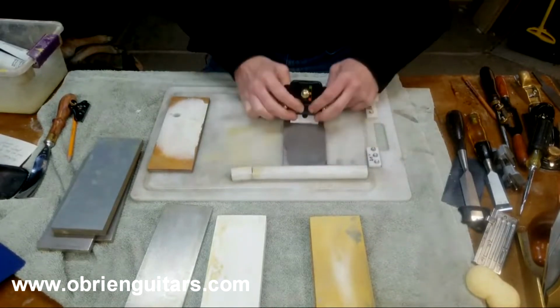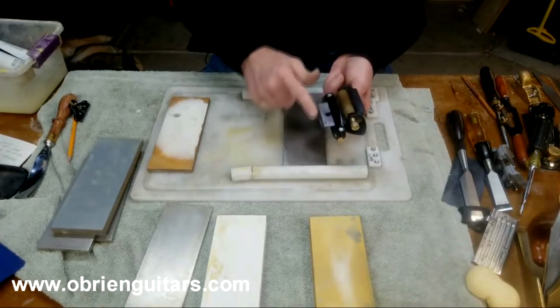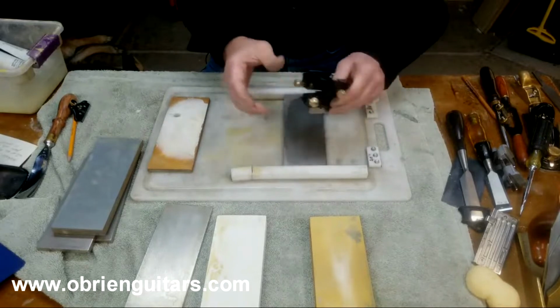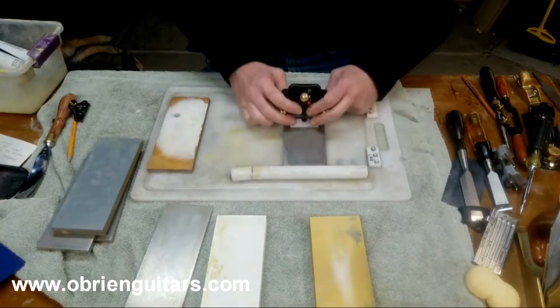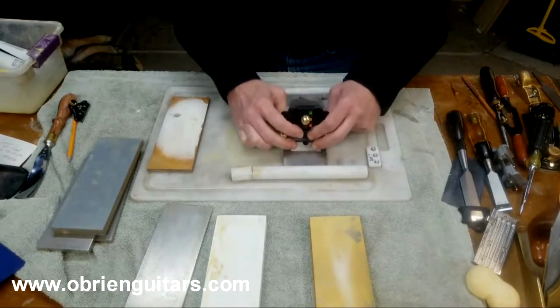All right. Now, if this was a regular water stone, I would have already been flattening it because my roller here and the grinding would have created a low spot there, and it winds up taking this thing out of flatness here and out of square. So that's another benefit of the diamond stones. I use a combination here of diamond and water stones, like I told you. Although I was taught just to use water stones, and I used that for a number of years.